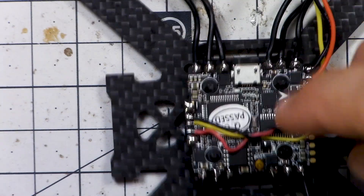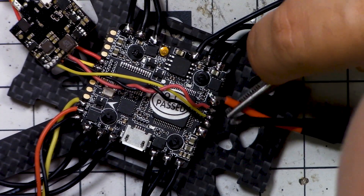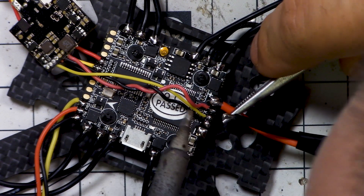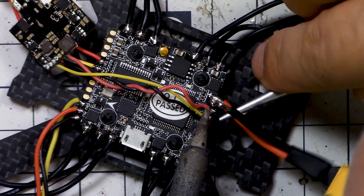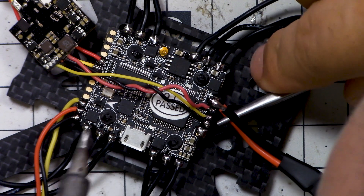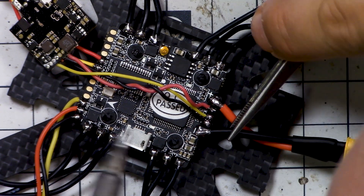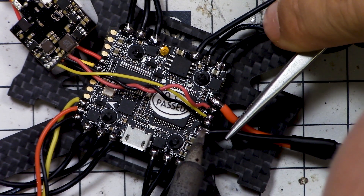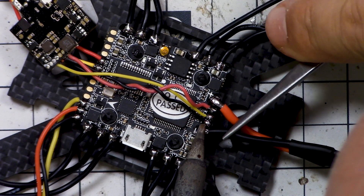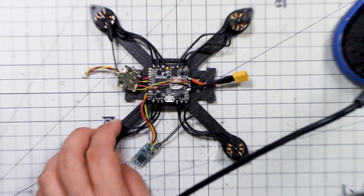Video transmitter is done. For this kind of connection it can be difficult to get enough solder on the pads to really make it work, but having a little bit of extra solder on the wire can help. You can watch the solder on the wire begin to melt as the heat is applied — you can even hear it.